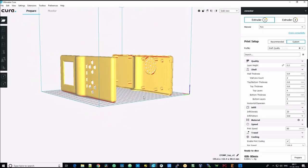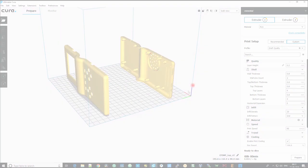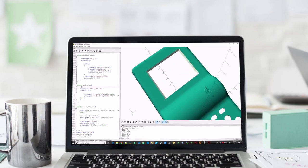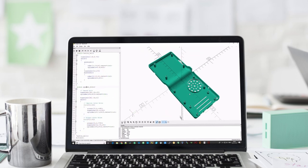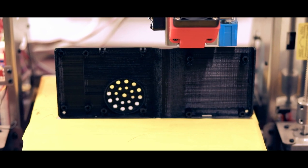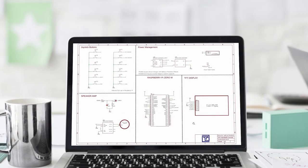Now let's design the enclosure for the console. I am going to make it into two parts — the top layer and the bottom layer. There is a cut for the 2.4 inch TFT display. I made an angle cut to the edges of the LCD area to make it look flush with the display. The buttons are rendered below. I am going to 3D print them in red, white and black so that I have options to choose from at a later stage. I have attached a simple schematic in case you plan to make your version of this console.